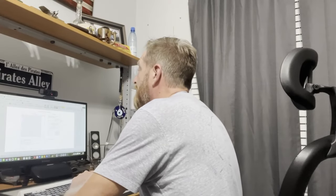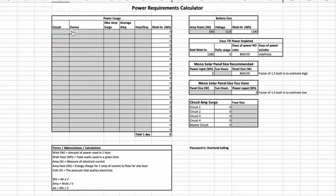In the power usage section, choose a circuit and put a device in. I'll put my fridge in — the manufacturer's website says 6.9 amps max power draw with an average of 0.9 amps, running 24 hours a day. It calculates the total watt-hours used and totals them. Right now it's telling us we can run the fridge for 4.6 days without any charging whatsoever.